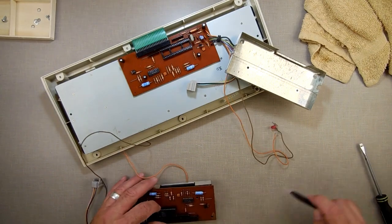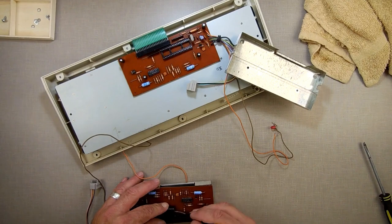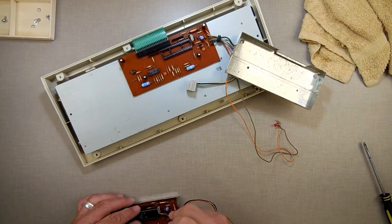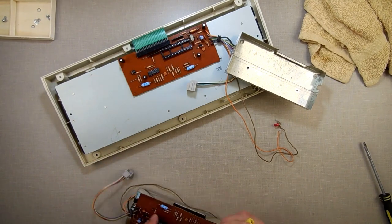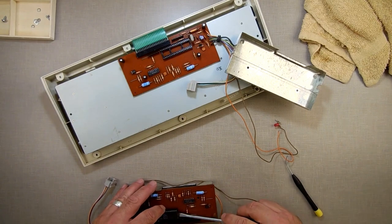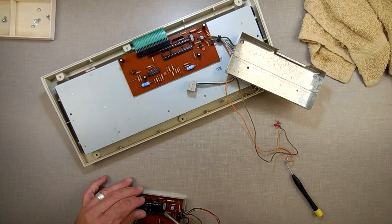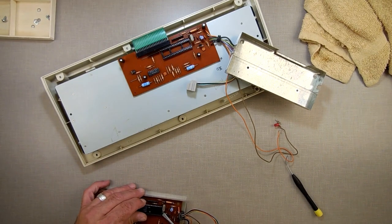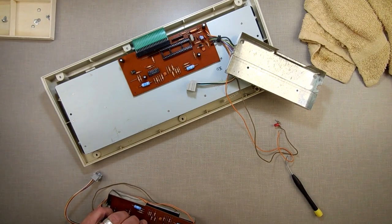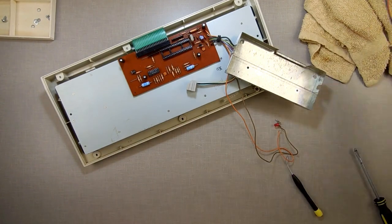The air's pretty damp right now because we've got storms coming. So maybe I don't have to worry about static today. During the winter time, oh God, I had a problem with static. I'm walking around my office here, hardwood floors, with my rubber-soled sneakers on, and I am building up a charge. I touch the doorknob, and snap. It got to the point where I got out my little slippers, and I'm walking around the hardwood floor in my slippers, just so I don't build a charge up and fry something.